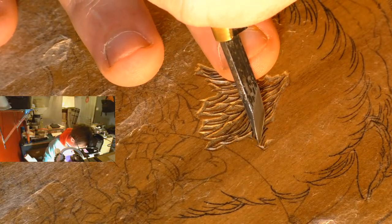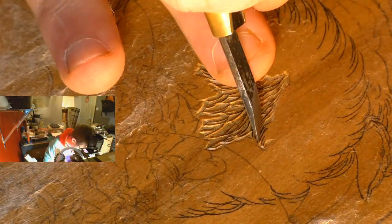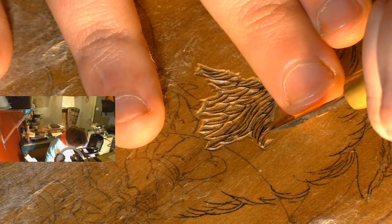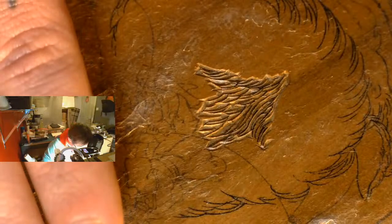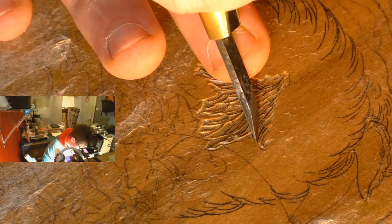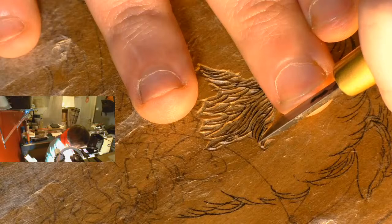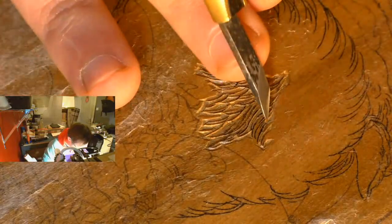It's like a tabletop plane that strips away some of the wood. And then we do some finishing with planes, getting it down to a certain level, and then I do the final wet sanding. And that is to make sure that I have a surface that's as smooth as possible, so that when I put the pigment on, because any loose or ragged grain would soak up water and pigment in different ways, you would run the risk of having blotchy or ragged looking printed colours.